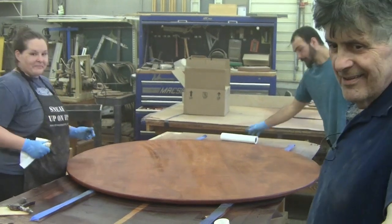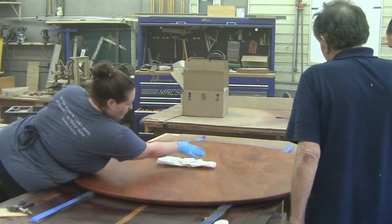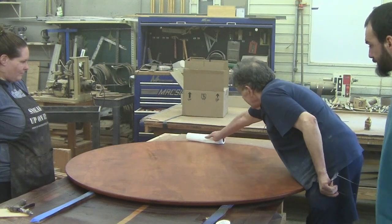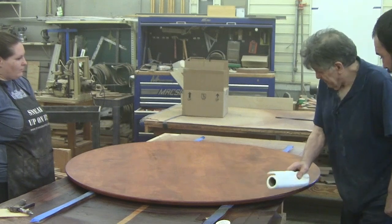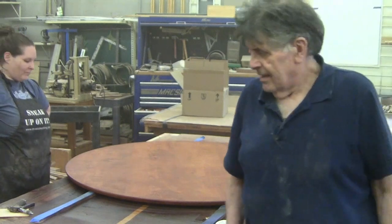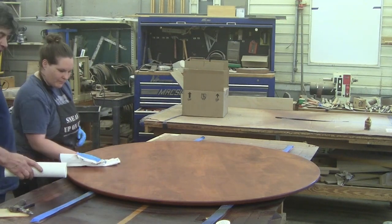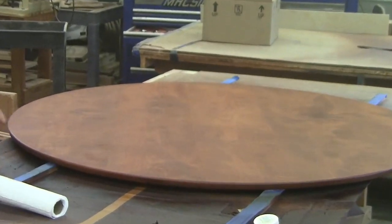Okay, you see right here? Wipe it straight again. Here. Now, one of my tricks, actually, I see it, hold on. Take a roll of paper towels, and use it just like a squeegee. Wipe with the grain. You basically wipe it to dry. And up here where I had the light spot, it's gone. Now, I don't know if you can see in the camera, it'll dry back a little faster. But again, as you saw, when it's wet, it's gorgeous.